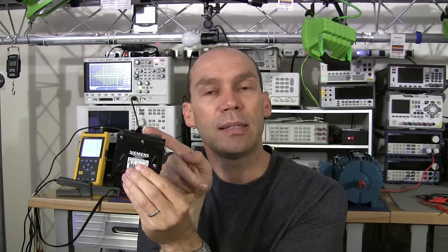The first part — handling a constant load — is handled with a bimetal strip inside. As the bimetal strip carries more current and heats up, it starts to bend and that triggers the trip. If you get a huge overload — say a short circuit — you could have 100 to 1,000 times the current rating flowing through your wiring. You want to stop that very quickly, and that's where an electromagnetic solenoid comes in: coils wrapped around which can energize a plunger, and when it gets a really high peak current it clicks in and also triggers the trip.